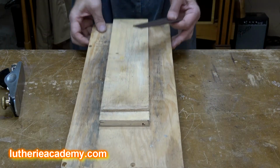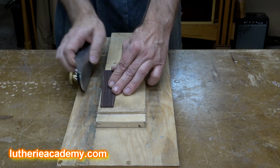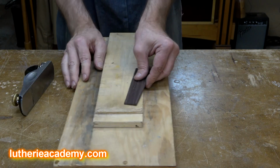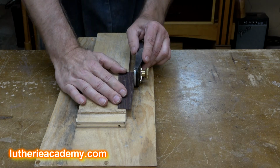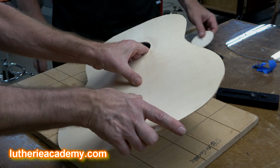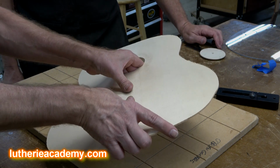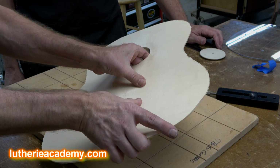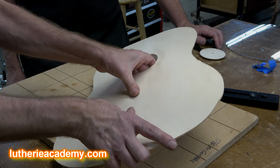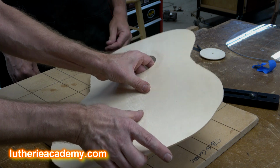All right, so I've got a shooting board here that's right and left-handed. The reason why it's right and left-handed is because I can see my lines here. And then when I turn it over to be running downhill, I can't see my lines anymore. So I just work left-handed. What I do is I can now get my hand in that sound hole and come in here like this and flex it. Just very lightly. Be careful you don't crack your center seam. Get your thumbs in there and just give it a light flex. Right on the seam and just a little bit off the seam. It's probably not going to mean anything to you right now, but over time you'll start to develop this working library of what stiffness and looseness is.